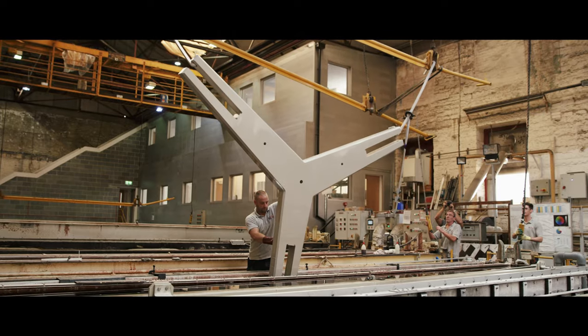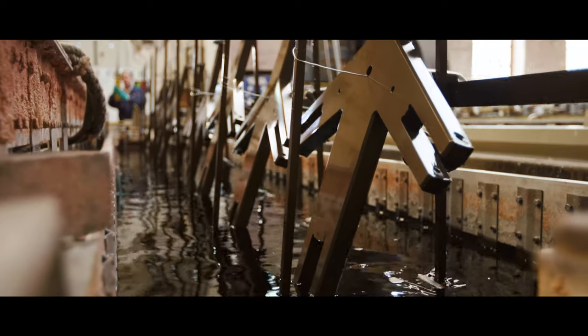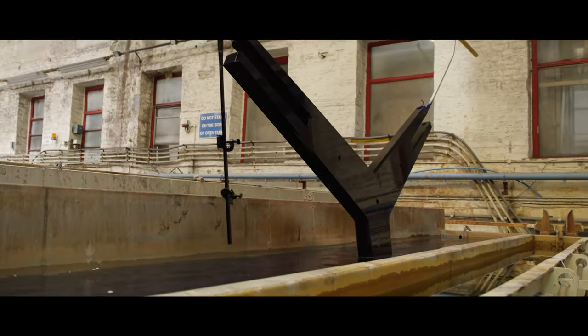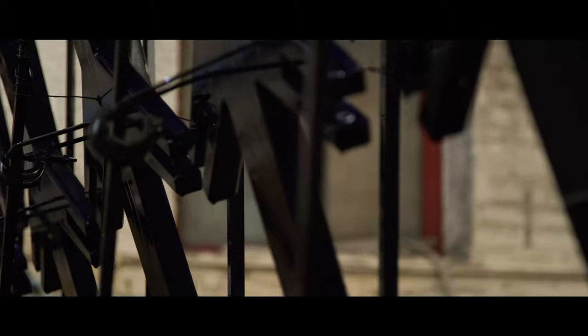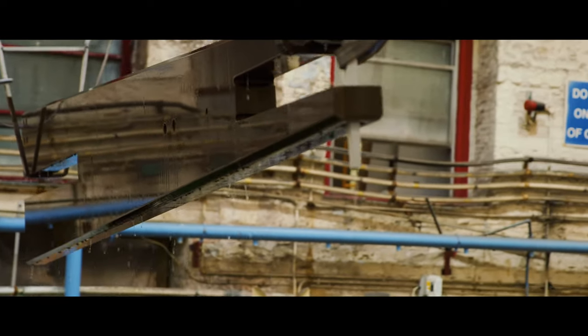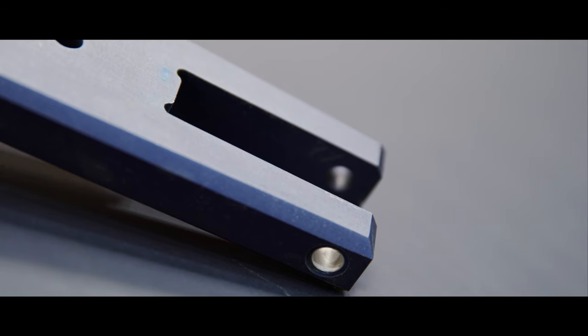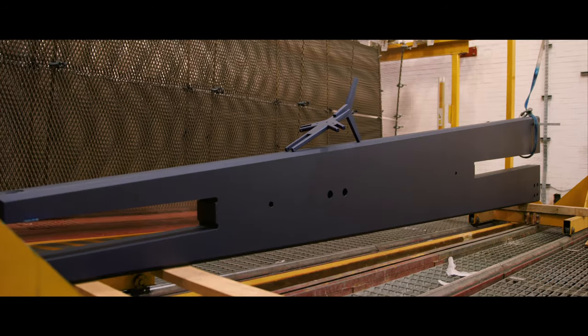The process itself etches away the surface by removing 25 microns, which is about a fifth of the thickness of human hair. On this particular project there's a special colour where we have some bronze colouration and some blue colouration to give the desired finish. I find it all really interesting because the anodising process needs every element to work correctly — from the guys putting the right parts on the right jig in the right way, to finishing and measuring it at the end. The most dramatic change is when we shift the colour from the silver of the metal to the coloured finish the client ordered. In the Bicamera project it changes from silver to bronze and then to the blue finished colour. These are the largest parts we've ever anodised in this company in the last 10 years.